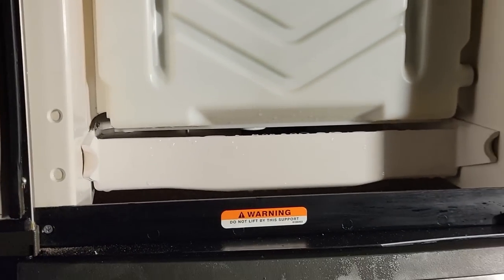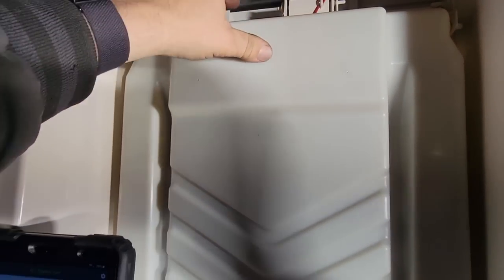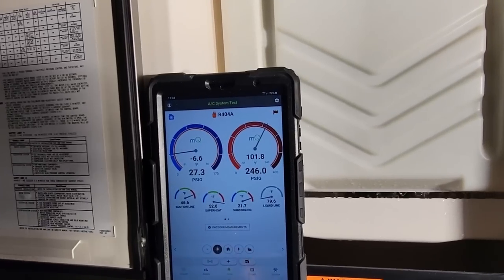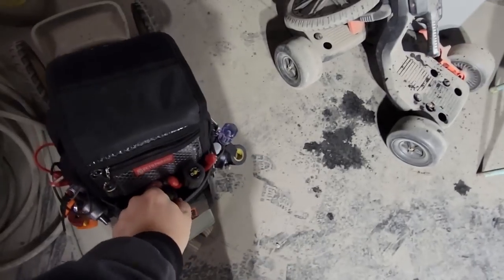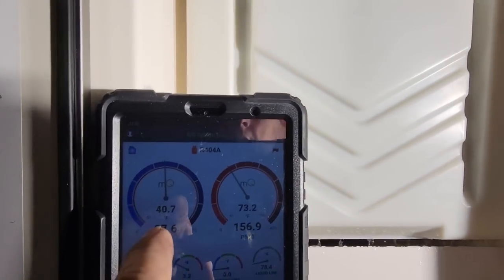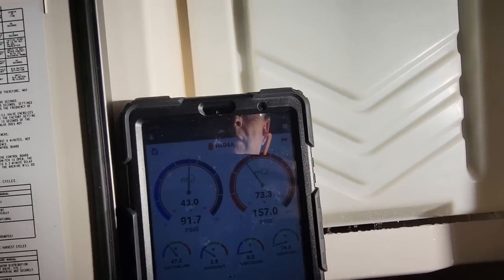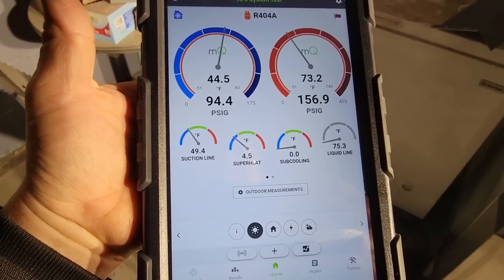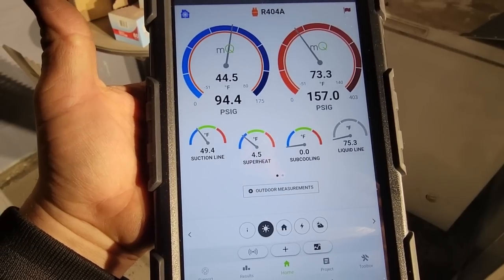Let's make another batch and time it this time. We may need to make it a little thinner possibly. I think I just heard my first click — we should be going into harvest about now. The probe's just barely touching, so we're going to make a quick adjustment. We did finally go to tablets at the company a year ago — now I've got a way to check my temperatures and pressures a little easier. Let's do a quick adjustment on that thickness sensor. It's lit up — should be about 10 seconds and it should go into harvest. Watching our suction pressure there — we're going up into the 90-plus area, which is generally a good sign. That's compressor superheat.